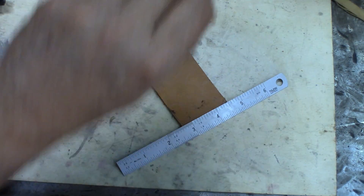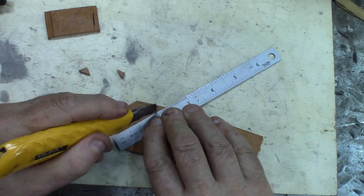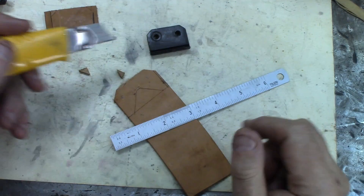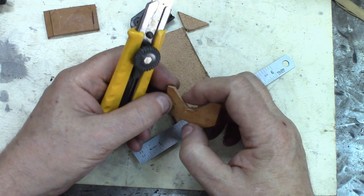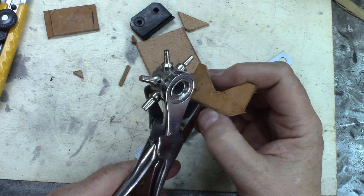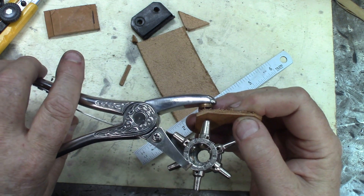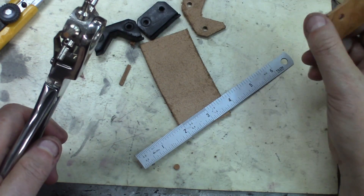I use a little steel scale for cutting. If you care about doing this properly, you can make yourself some steel plates that will shape up the leather, and use that method to make proper wipers — that would work no problem at all. Cutting down — it doesn't have to be 100% perfect as long as the shape is pretty close to the original. I've got the luxury of having a leather punch to make a hole for the screw. This is the square one; this is the V-shaped one.